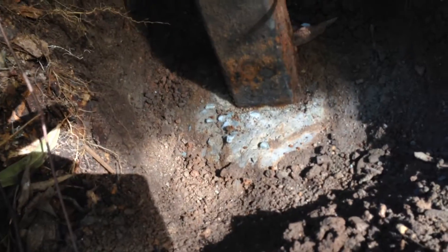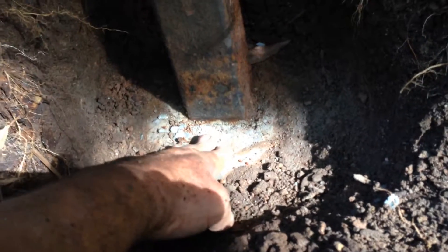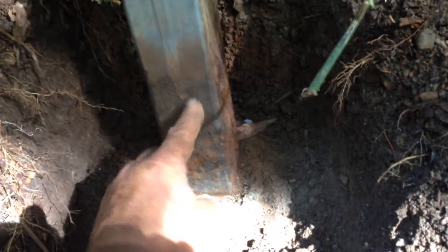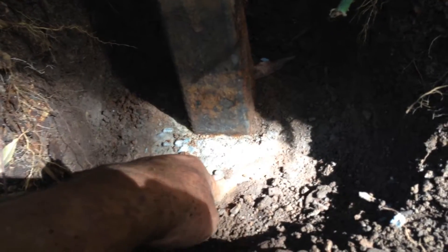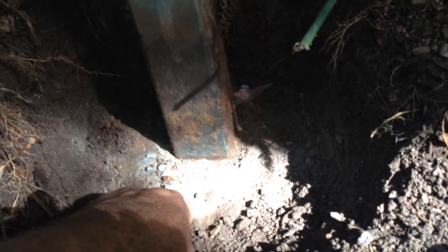As you go, dig down to try and get to the bottom of these posts — that's where the concrete and steel meet. Clean that up; you want that totally clean so you can put the concrete on. I've got to get this rust converter on — as we've seen on the other video — I'll put that on in a minute. It takes a few days for the rust converter to do its job and dry. Then we'll be painting all that and around that edge, good two inches past, so it's all completely sealed with the epoxy. And then the same again with the tar after the epoxy dries.